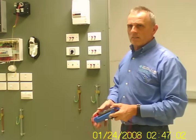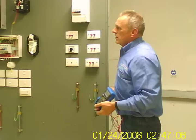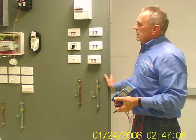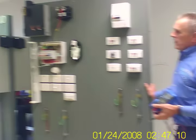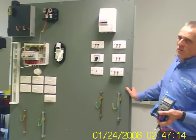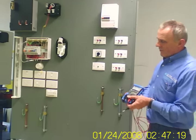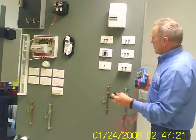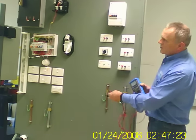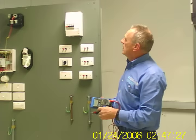This is the MEN question. Basically, what they're asking of you is what type of volts do you get on the earthing system when there's a high resistance neutral or a broken neutral? You're here to use your voltmeter to determine certain volts on the earthing system, and the rest of the volts will be on the installation.